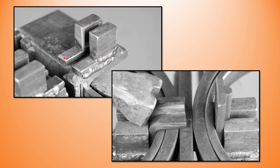These are the blocks on my jig. You can notice I've got a little bit of room there for clearance for my bead all the way around. And then the height of these has to accommodate room for your set hammer or your hide mallet to come in and make the final bends.